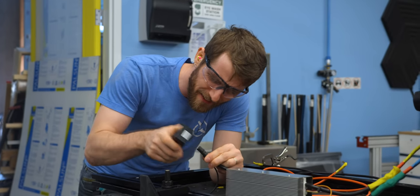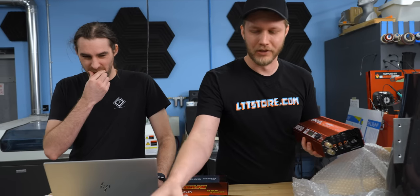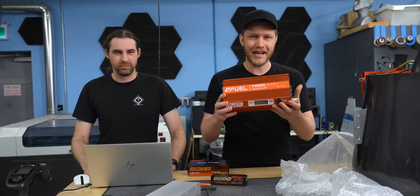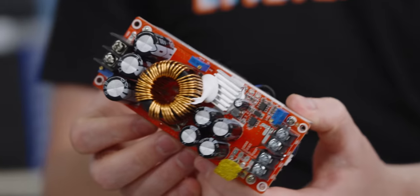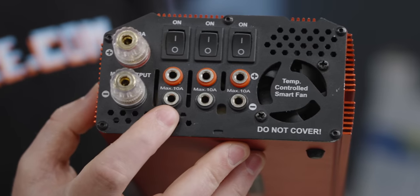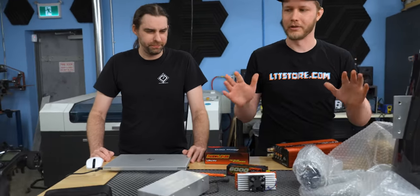Before we just connected it to the battery though, Alex and Kyle over here needed to make sure that it worked. The plan, so we hopefully don't blow up something if something's not working correctly, is to use this power supply and a boost converter so that we can have 48 volts coming out of this into our fan, and we'll have current limits right on here so that if something's incorrect, nothing goes super bad.